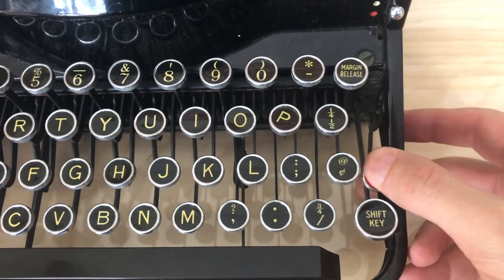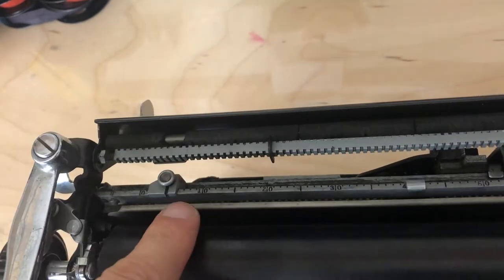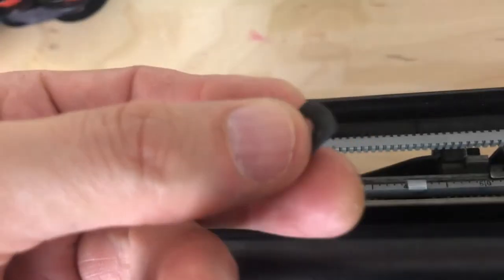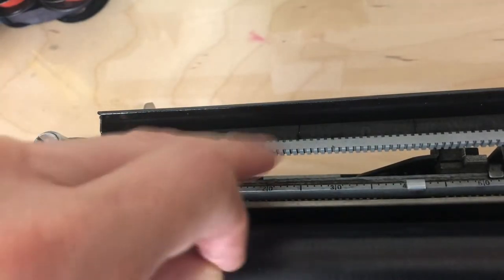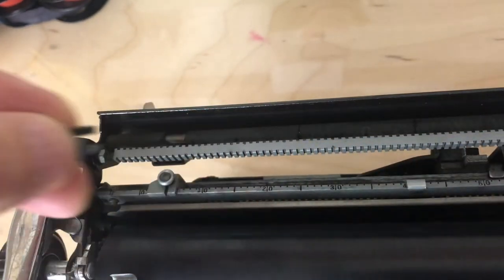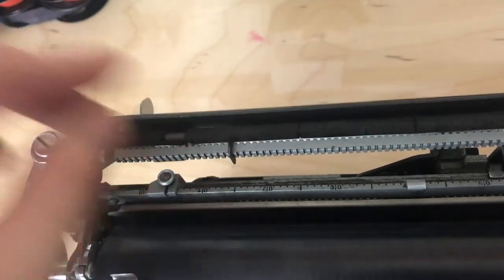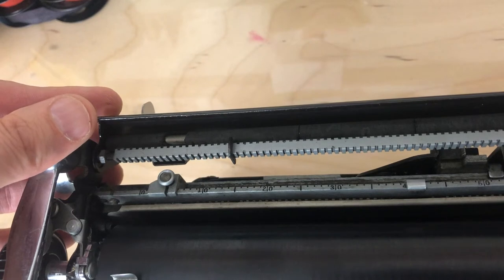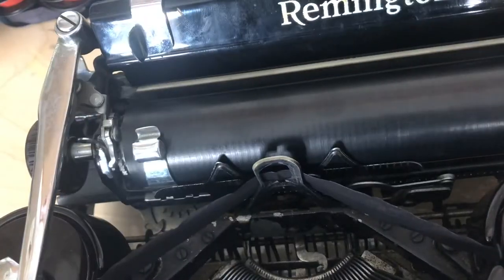This tab key — let's see if it works. The tab key certainly shuttles the carriage, that's good news. Here's your tab rack along with your margin sets right here. This little metal nub is what actually tells the mechanism to stop. On older machines like this it probably came with five or ten of these, and right now we only have one left. I'll insert that right about here, and if it's working correctly the tab, when depressed from the left-hand margin, should stop there. That works.